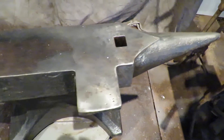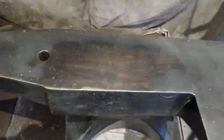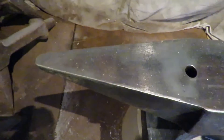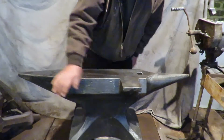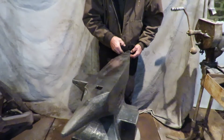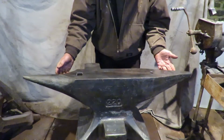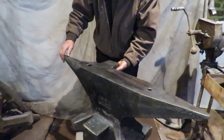There's slight porosity on the side shelf, which you can see here, and again you can see slight porosity near the round hole — both from the original casting — but the edges are pristine and the anvil has not been used. As we rotate the anvil, you'll see that the upset block is on the side toward you, and you can see 220 cast into the side of the anvil, which is 220 kilograms, translating to 484 pounds.